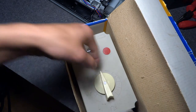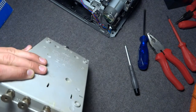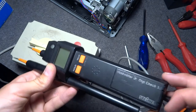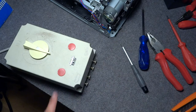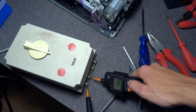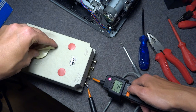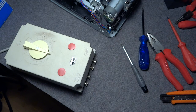Let's actually try that out, because I happen to have a DC power supply which I will connect to this motor and the other motors as well to see what they do. This is a model railway power supply made in eastern Germany, so it obviously outputs DC. I also happen to own a crappy DC voltmeter — this one's going to be very inaccurate at telling us how many volts are coming out. It's connected now, it's getting power. We get 8 volts at minimum and just under 16 volts at maximum. That means we're not going to break these motors if we connect this power supply to them.